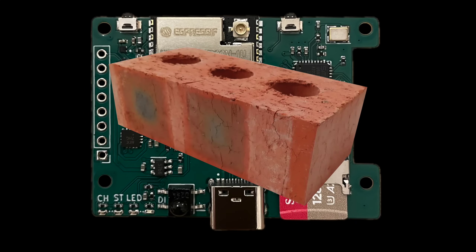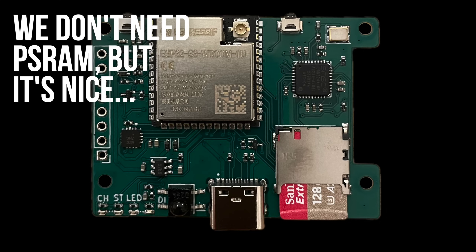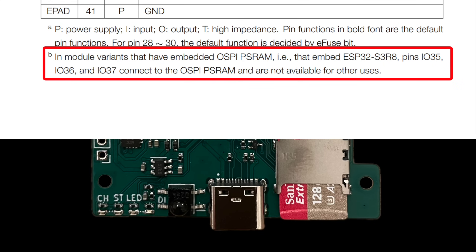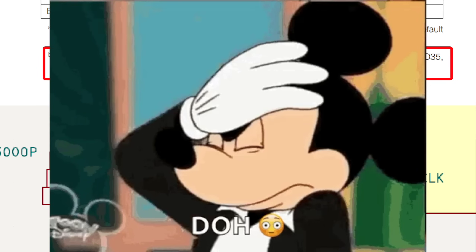So I'm thinking of moving to having two USB sockets - one for the ESP32 and one for the USB 2244. With the ribbon cable working, I can lose the pin header, which gives me a bit more space on the board. I could even skip the USB socket for the ESP32 and just have a programming header for it. Another issue I found is that the module I'm using has 8 megabytes of PS RAM. Enabling this caused the board to crash as soon as I tried to use the SD card, because PS RAM requires avoiding GPIO35, GPIO36, and GPIO37 - and of course I used all three of those pins for my SD card connection, so I'll have to shuffle things around to avoid those and the JTAG pins.